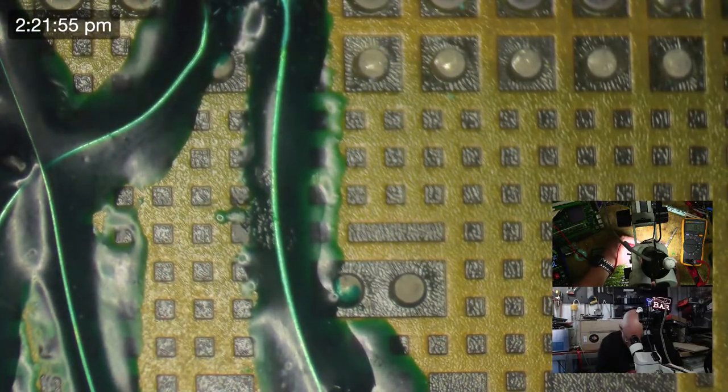Okay, getting 0.2 there. So let's now measure from there to the other side. Break on through to the other side. There we go, there to there. 0.1. Okay, so it's no issue with the pin on the socket, and it's no issue with the wire going up underneath to here. The resistance is happening when it gets through to the other side of the board. And you know what that means, don't you? Means we've got to take this battery holder off.